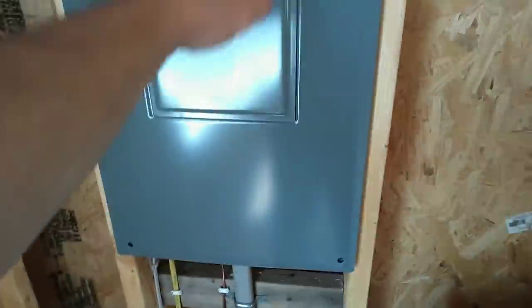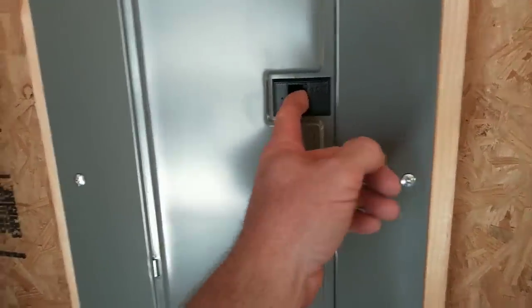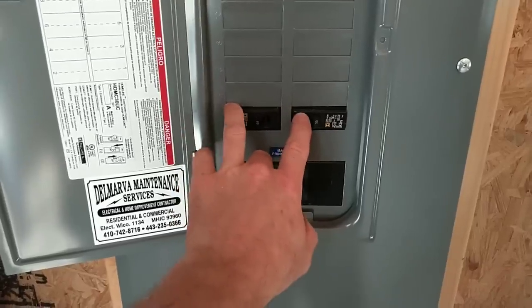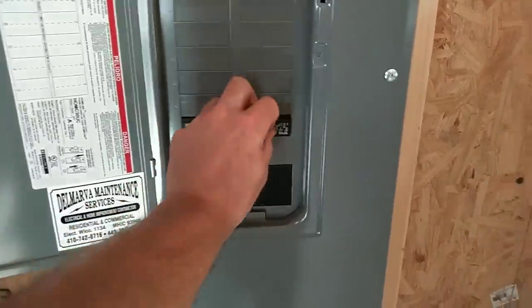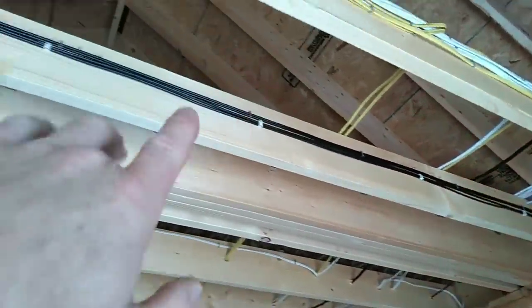Coming over to this panel — like I said, it's in the master bedroom. This is a Square D HomeLine 3060. We've got a couple of wire pulls: one going underneath the house for the condensing unit on the back corner. Square D changed the plastic color — it's now black instead of gray. We've got our 200-amp main breaker in place, two breakers with the knockouts removed that I have to fill in for rough inspection. One breaker is feeding temporary power for outside outlets. Almost all wire overhead, stapled to the side of the joist. RG6 wires right there, coming down and penetrating through the wall.